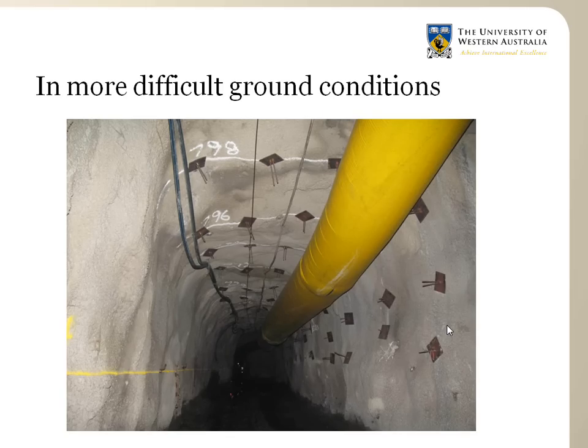One of the disadvantages of the fibercrete is that when the rock mass deforms under pressure, the shotcrete will crack. When cracks open more than, say, 30 to 50 mm, it becomes not effective, and pieces of fibercrete as well as the broken rock behind the fibercrete can fall down and become a safety hazard.